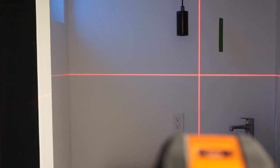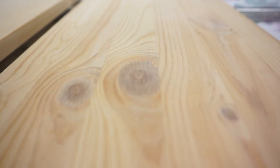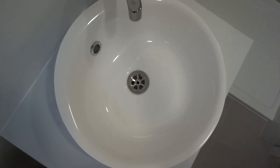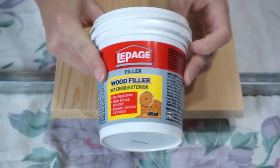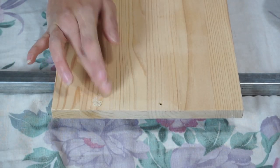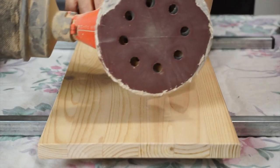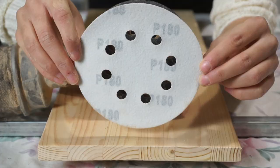First things first, I'm going to hang up some shelves so I have a place to put my decor and basics like cream soap and towels. I've got these pine shelves from Ikea — not sure if they still sell them since I got them six or seven years ago. I've got a beautiful walnut-style vanity in the bathroom and I want to bring that color into the shelves. I'm filling old holes with sandable and stainable wood filler, scraping off the excess, and once dry I'll give them a quick sand with 180-grit sandpaper.